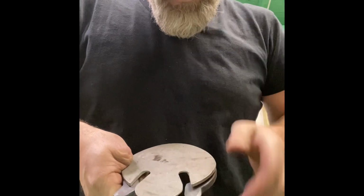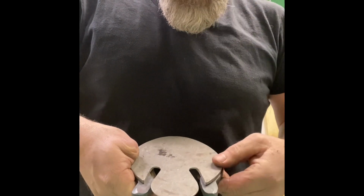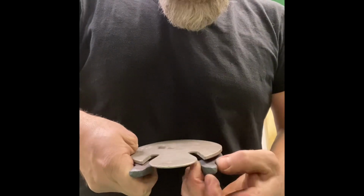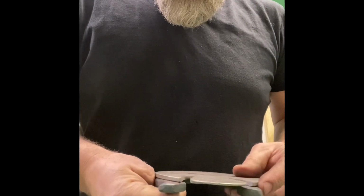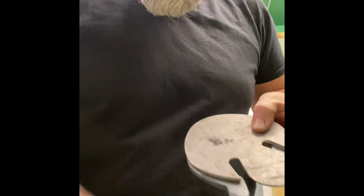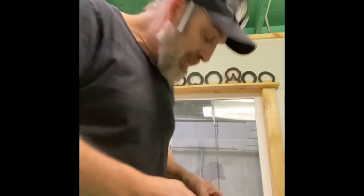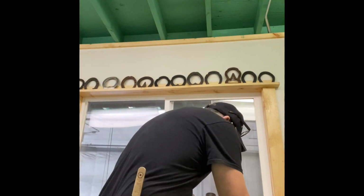It should not, or your extended heel, sorry, it shouldn't be into your frog. It should be off your frog. It should maintain that 3/4. Same thing here. Fit to your boxing, 3/4 of an inch out. And this shoe I did not make to fit the pattern, so I'm kind of moving the heels around just to show you where it needs to be on there.